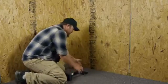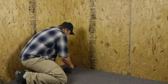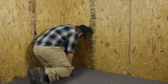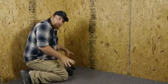Now after that, you'll actually have some wrinkles going on a 45. So then you take and you put it here, going at a little bit of a 45, and then you stretch it here. That way, it stretches all those wrinkles out, and you can work those towards your wall, and it makes for a very nice looking carpet.